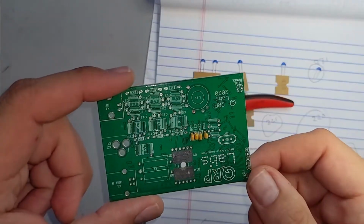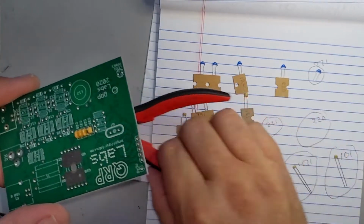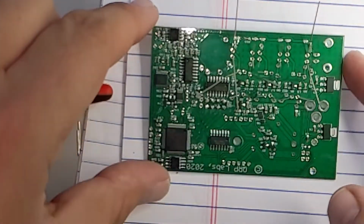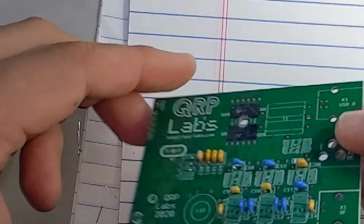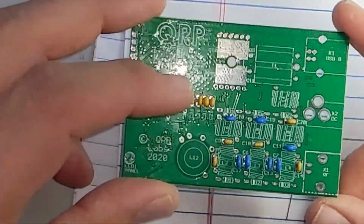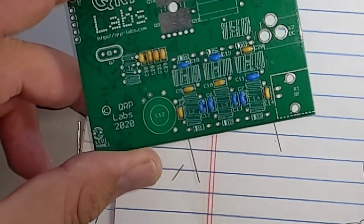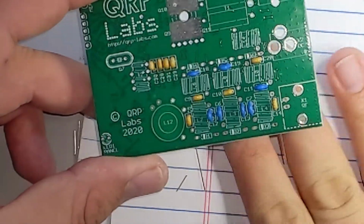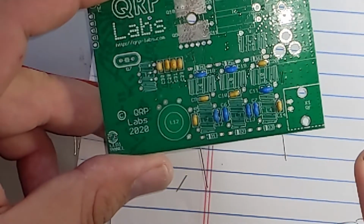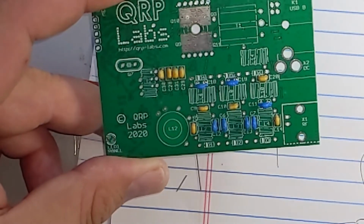All right. So I'm going to do the rest of the capacitors off camera, and then we'll come back. All right. I've gone ahead and inserted all of the capacitors here, and I haven't soldered them in just yet. But what I wanted to share with you, the way I went about it, I simply grabbed one from one of the marked ones, looked for it on the schematic in the manual, made sure I matched it here, inserted it, moved on to the next.